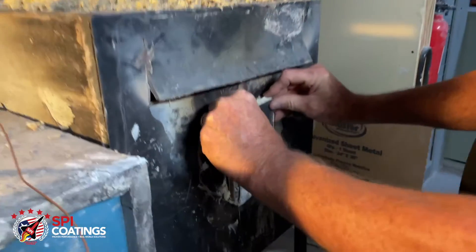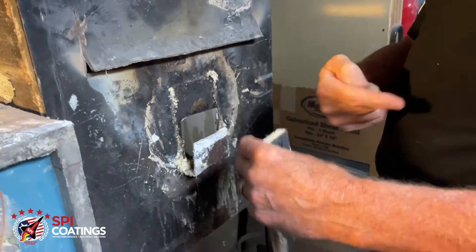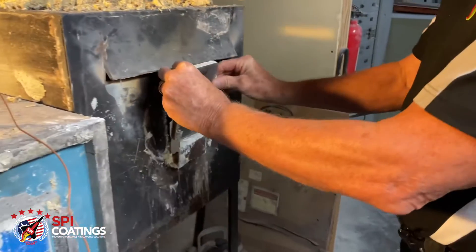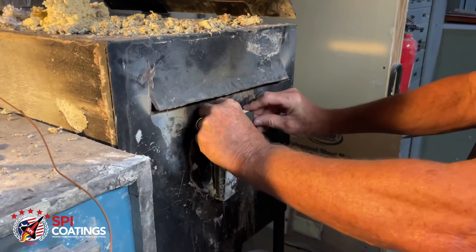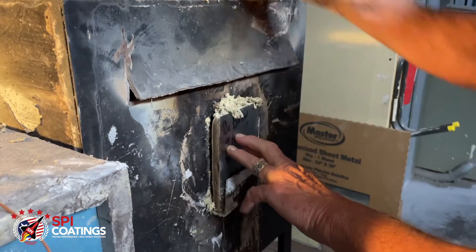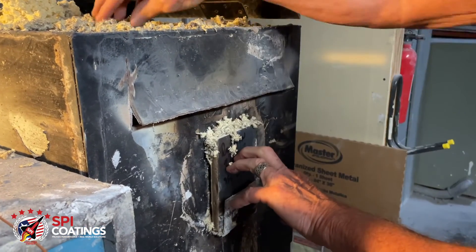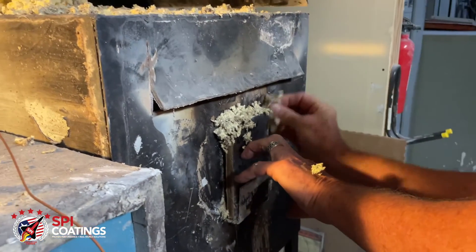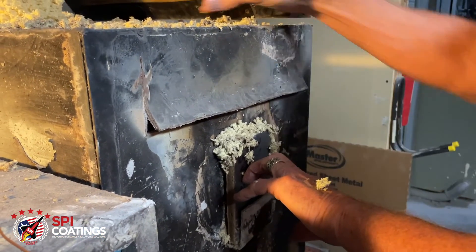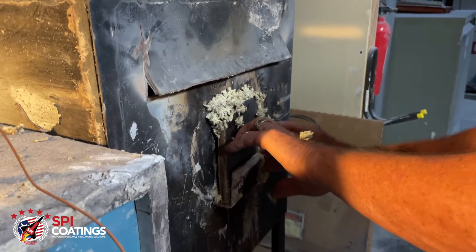We can get a good idea right here by putting the plate in and the burner is right over there — it's going to be hitting the face of the plate, impinging directly on it. I'm going to put this surround here to keep the heat from coming out around the edges of the plate, like they do in the fire lab, so all we're getting is the heat coming through the coating and through the plate.